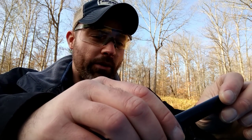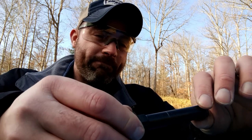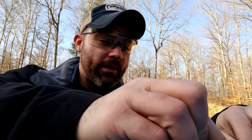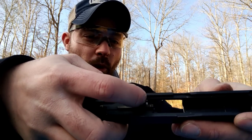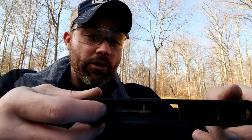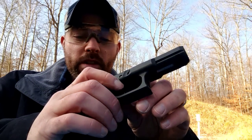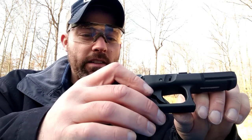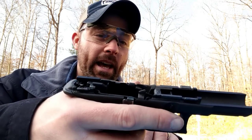Nothing has really cropped up other than normal wear — no marks coming out in the barrel itself as far as polishing, just that slight movement of the barrel being a little tighter. Looking at the slide internals, most of those wear areas are now nicely polished up. Everything is free and moves very freely, even though it's grimy and dirty. The lower receiver is gunked up right now, but most of those wear parts are polished up just from shooting at this point — it's never been detail-cleaned.